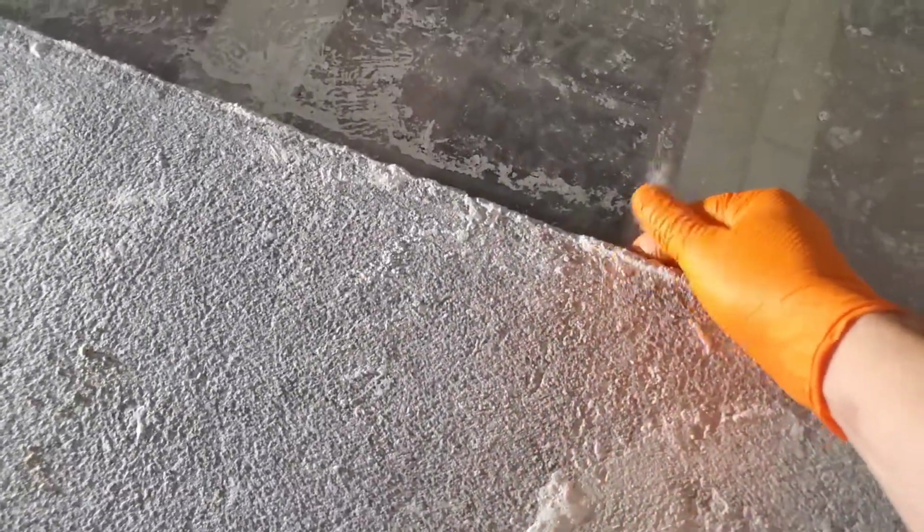This kind of thing right here, you could chisel that off, but my 5-inch grinder will knock it right off there. So the elevations are critical here. I'm grinding this just to get a nice flat foundation to start with, and then from there I'll get the topography of the floor mapped out. All right, because we're going for flat, and if possible we're going for level.